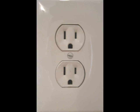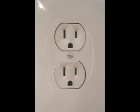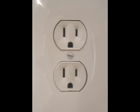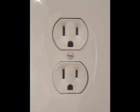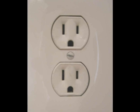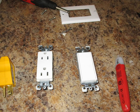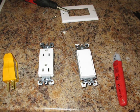This video is about electrical problems in our kitchen on one circuit, which is comprised of an electrical plug, a light switch, and the lights and fan above the stove. The lights and fan above the stove weren't working at all, only half of the plug was working, and the electrical switch wasn't working at all. The first thing I did was check the electrical breaker — I turned it on and off a few times, but it hadn't been tripped. I was baffled by the fact that only half the electrical plug had current.